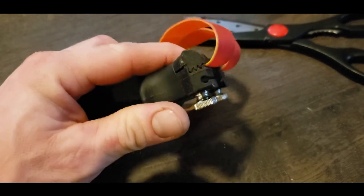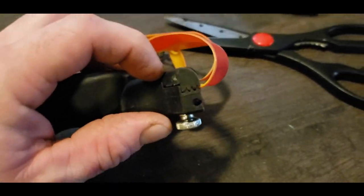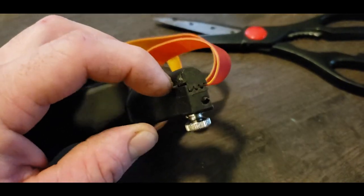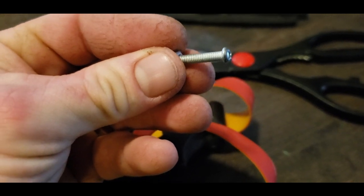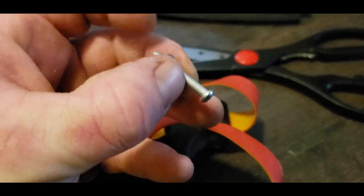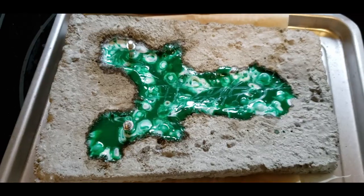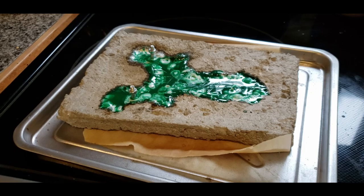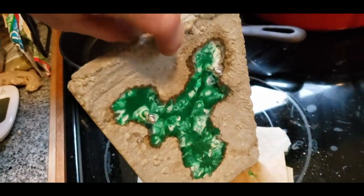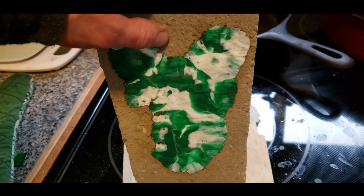This slingshot — which you can find on my website selfentertained.com — has these little threaded knobs and clamps. I'm going to mimic this in a future video by making a similar clamp. I'm going to set the bolt end into the plastic while it's molten, and then that will be what tightens the clamp. Now I'm just letting it cool — you can see I've got my bolt heads sticking out the back. I'll punch it out through the back once it cools down a little more.